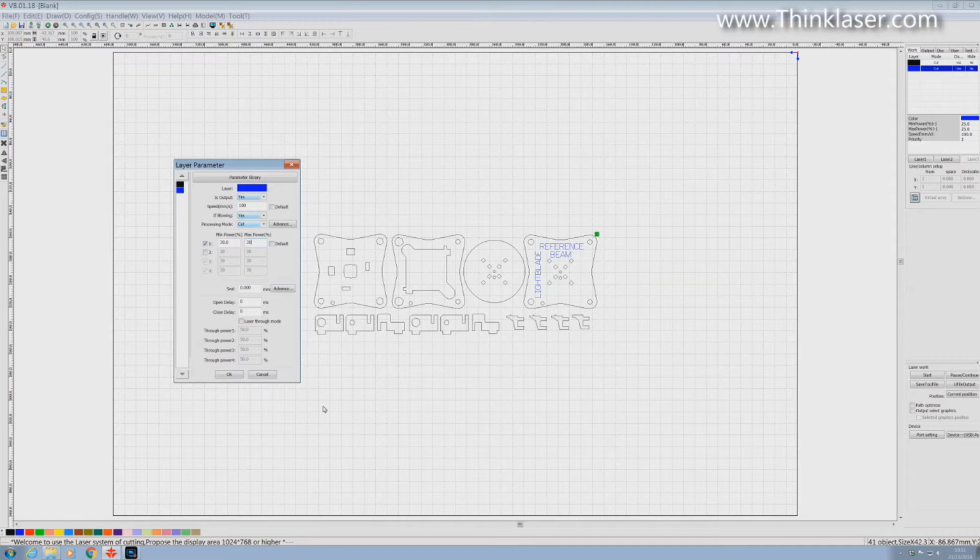So you may as well plonk something reasonable in there. 100mm a second is still unlikely to be achieved by the machine, but we don't want the machine to cut all the way through. So we need to keep the speed fast so that it stays as fast as the machine can go. The next issue is the power. We're going to be using 3mm thick acrylic to do this job, and even if we were to apply maximum power, the full 60 watts of my machine, we would not be able to cut through this material at 100mm a second. So therefore it really doesn't matter, but what we're going to do is back the power right down to something like 30%, so that we can make sure that we scratch the surface rather than go deeply in.